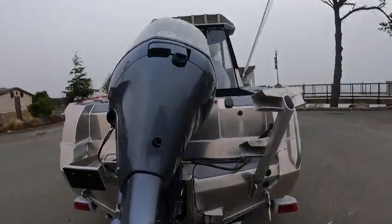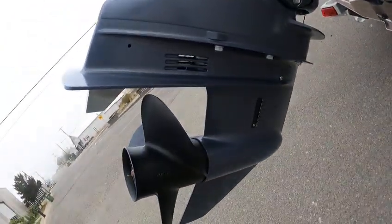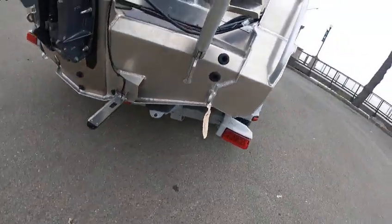Here's how you change your oil right there. Your muffs flush right down there. That's how you check your gear oil — you drain it down below right there.